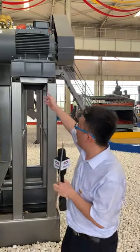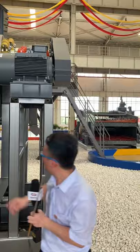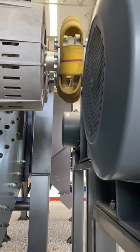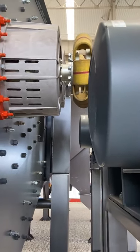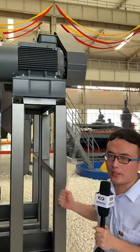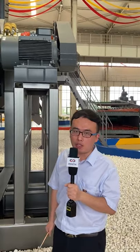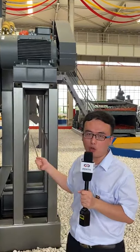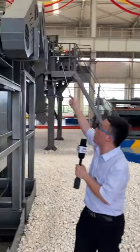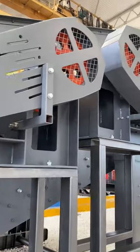For the connection, we adopt a flexible connection transmission — you can see the yellow component. Compared with traditional direct connection, it protects the motor and V-belt from vibrating force, making both the motor and V-belt last longer. This cover for the V-belt also helps extend the V-belt lifetime.